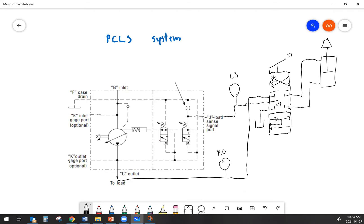We've got a few different things going on on the pump. This right here is our servo, and this is going to be our pressure compensator spool and spring. When we first fire up the system, the pump is going to be fully stroked — the servo has a spring in it and that spring is going to force the pump's swash plate to max angle, so the pump is fully stroked.